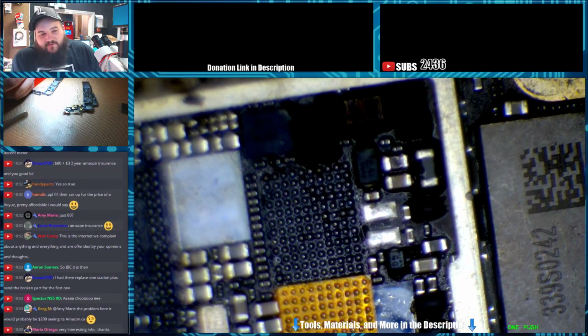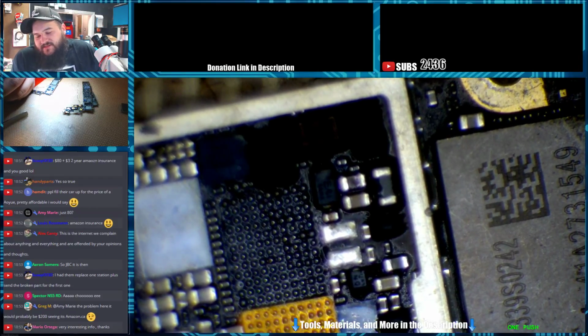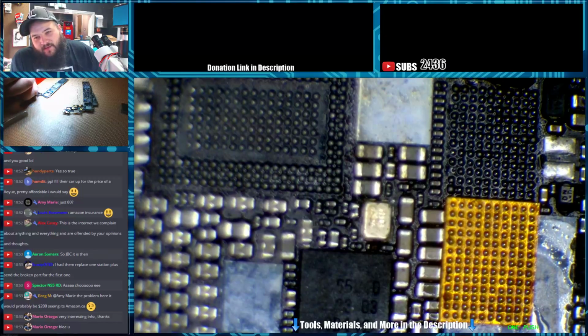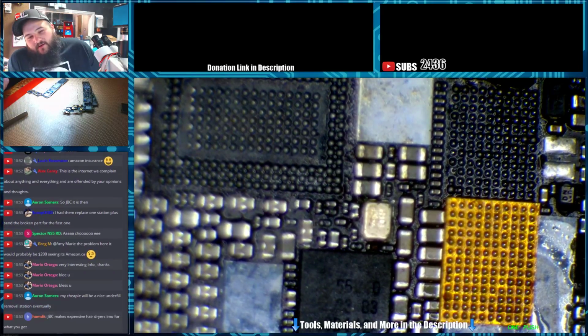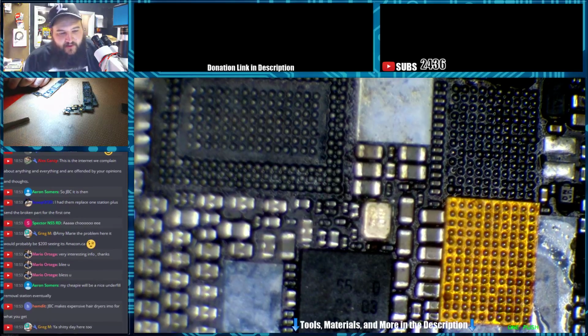Today's just been kind of a shitty day for repairs for me. A bunch of stuff works, but not the way it should. I've been working on a MacBook Retina most of the day. It boots up in SMC bypass, but I can't get it to boot normally. It has no image right now. It does chime. So it's got multiple issues after liquid damage. I've been messing with that. It did come in not even turning on, so we got it that far.